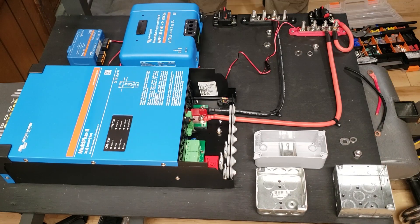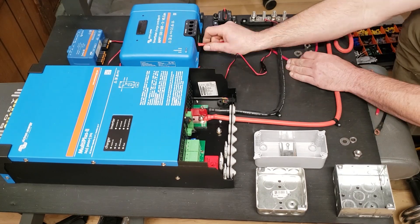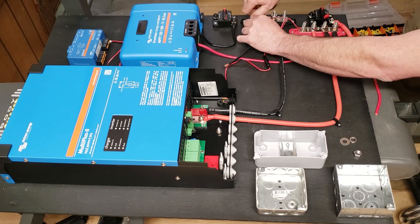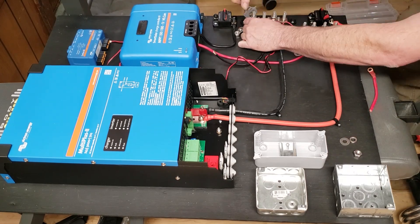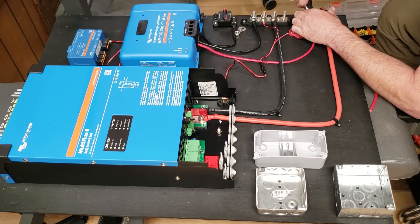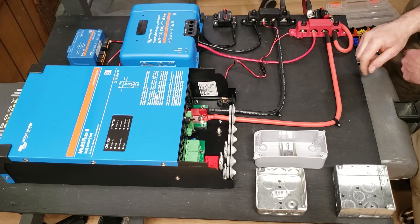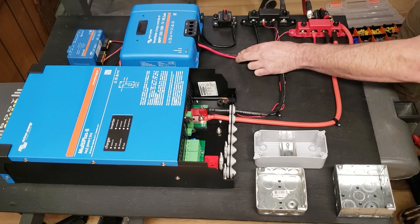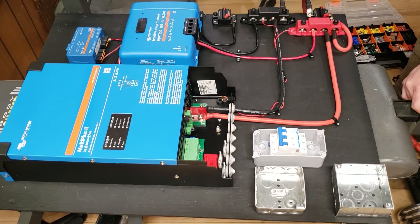Then I'm going to use some cable management ties to screw those wires into place. I'm going to run the power that's going to power the Cerbo GX, and then go ahead and connect the solar MPPT charge controller, also using one of those little resettable fuses as a disconnect — it's what I had on hand and it works quite well. Once you have everything set up, that's going to go from the solar charge controller to the bus bar to the battery so you can charge it using solar, and also go into the MultiPlus II to power any of your devices.